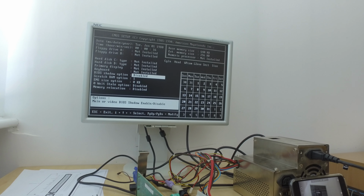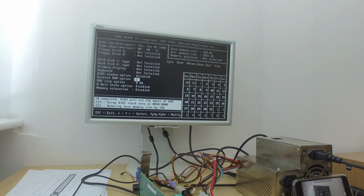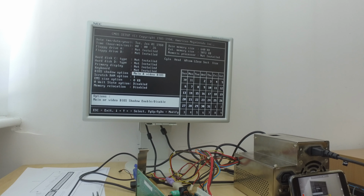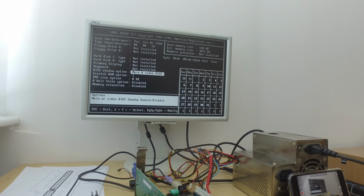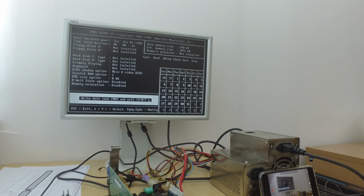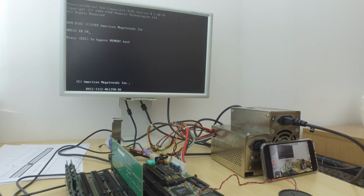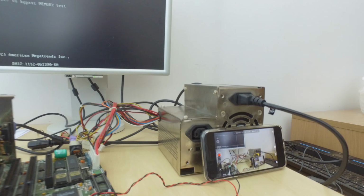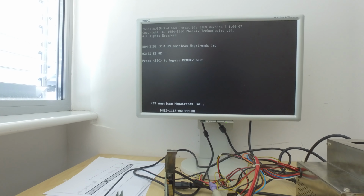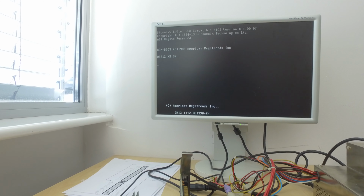These paper stickers on top of the chips let a little bit of UV light through. Maybe that was what caused it to lose its memory. And basically this computer didn't know what to do on a boot, so that is why no beep, no nothing, no error code, no memory counting, nothing happened, because this computer didn't have any BIOS, which is essential for a system like that. So I guess that's my main tip for this first part of the restoration.